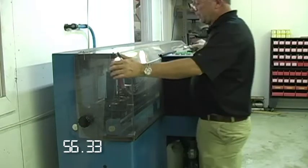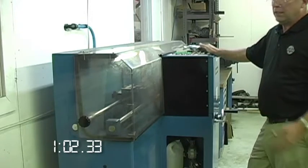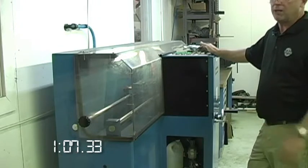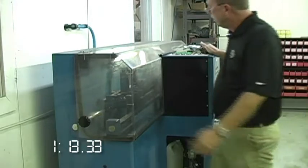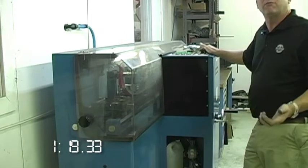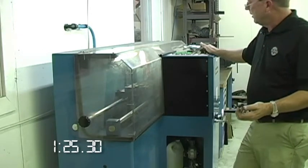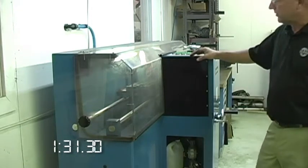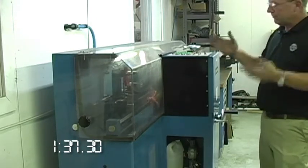How many passes will this take? This will take about ten passes total. I'll do two passes at each in-feed — two thousandths each time I in-feed. It depends on how much metal you're removing as to how often and how much you in-feed. As a rule of thumb, I always in-feed two thousandths. You're typically removing much less material on the front face than the top face, so I'll in-feed every pass on the front face, every other pass on the top face, as a general rule.